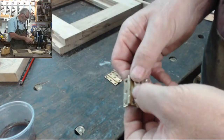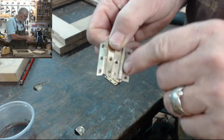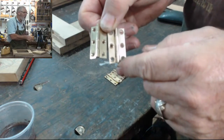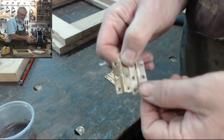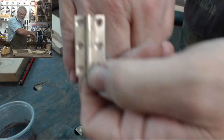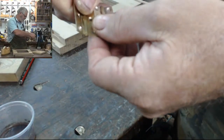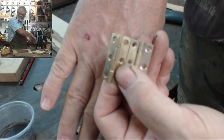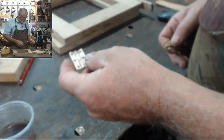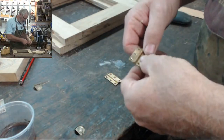Okay, so that's what it is normally. Very shiny and yellow. You can't see it too well on that. This has gone dull and it's a bit of a pinky colour. Now that was in an iron oxide solution, which is what I use for ebonising, and then that had salt on it. Let's see if I can. There we go. It's a bit better. And that was the difference. So you can say, oh, that's a bit better. You can see one's really gold and the other one's changed colour a bit. So that was straight iron oxide solution with salt, just left in there overnight.